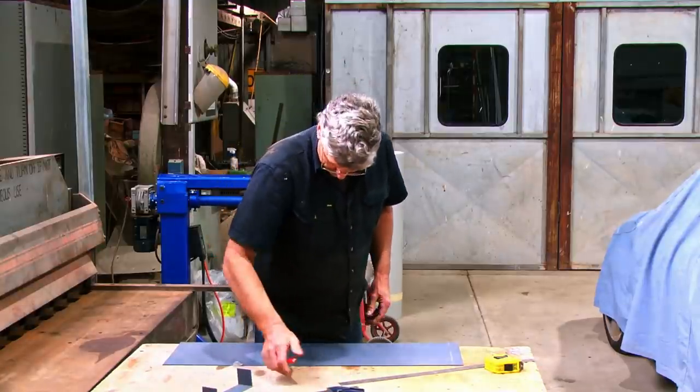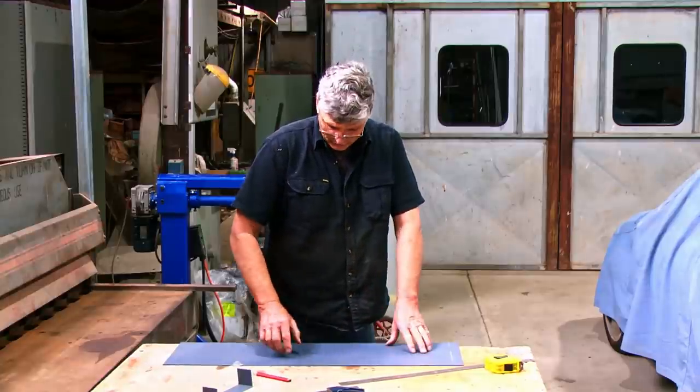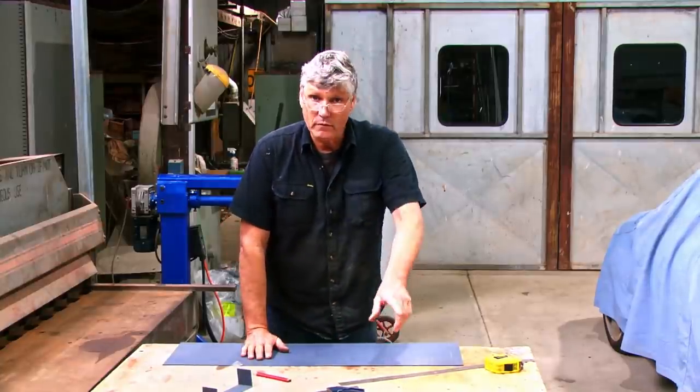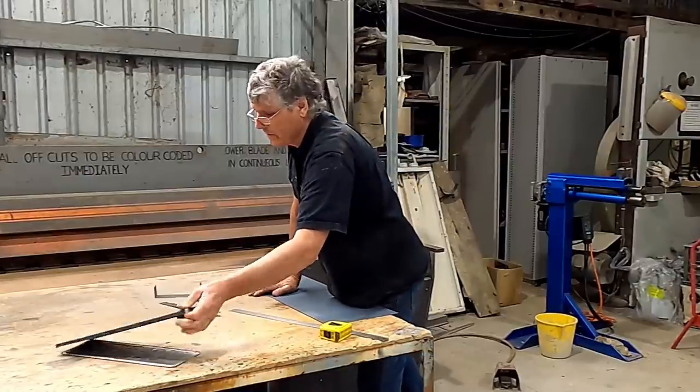Okay, so that's the middle there. I'll just grab one of our forming plates because that's what I'm going to make the hole to. What I want to do is form this opening up so that the plate we made to do the hammer form with the other day is going to be tight in the hole, and that way we know when we come to put it together.